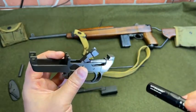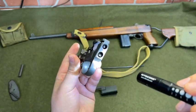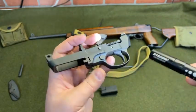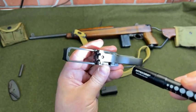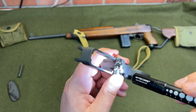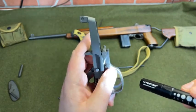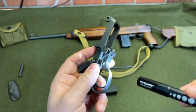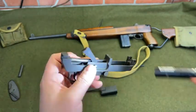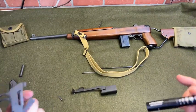If you have ever had to disassemble this, Seb, you'll know that putting this trigger together is a pain in the butt. So you'll see in here, the spring is in that little hole, and the two pins hold the fire control group together, kind of like the M16. And then down here are these push pins with springs in them, or not push pins, they're detents. Thank you. Detents, yes. Detents that ride against this, that give it its spring tension. And then the same thing here is another detent going the back way that acts as a cam on here. So it's the same situation. They didn't change it up at all. It just rotates. This shaft on the safety is different than the one that's on the push button. But learning from the process, learning from field experience, they just made small, minor changes that made things a little more user-friendly. So that is the trigger group.